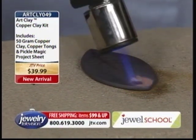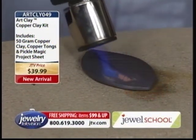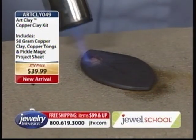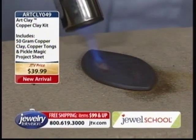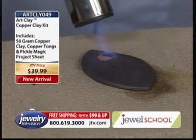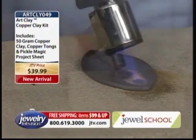The copper is going to be great because you're going to be mesmerized by that. Absolutely. Now, they're close up on me. Take a look at how close I am to this piece. This is not silver. If you get this close to silver, you're afraid of melting it. It will be nearly impossible for you to melt copper with this torch. I am right up on it, moving nice and slow, and the goal is to get as much heat as possible into this copper piece.